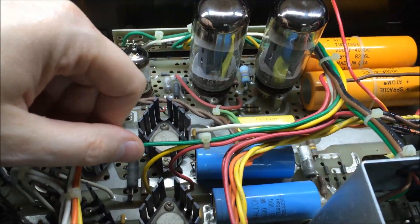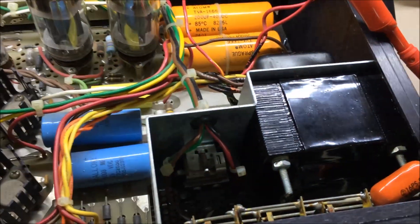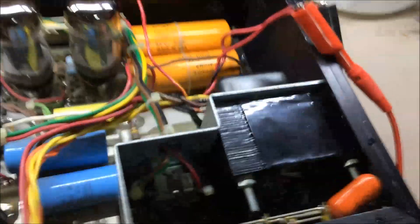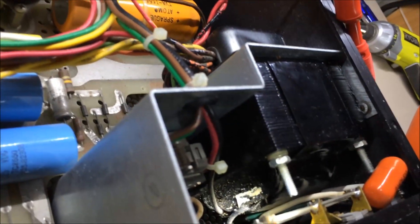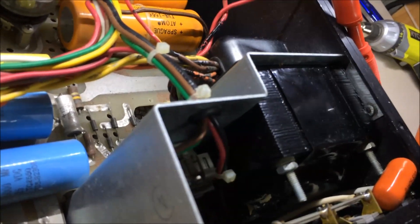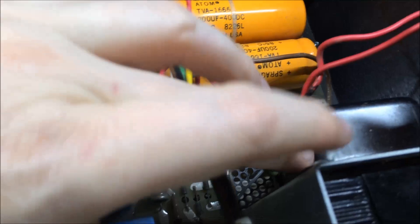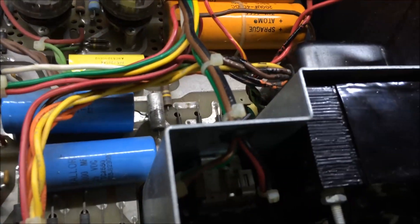What I did notice was that the smell was coming from over here in this corner, which is actually the power supply transformer. If I can get a light going on here — down inside, it's kind of hard to see — but you can see this thing's been hot before, this transformer. The wires here — the black paint coming off the transformer was all brittle and chipped off, which is not uncommon. So at any rate, I powered it on.